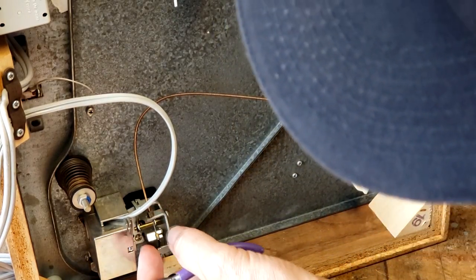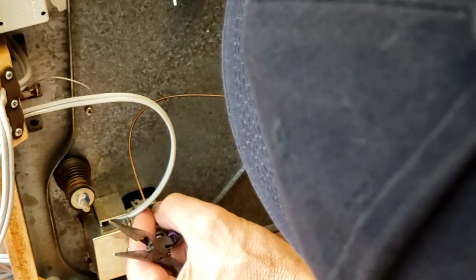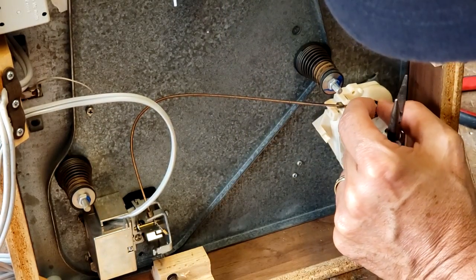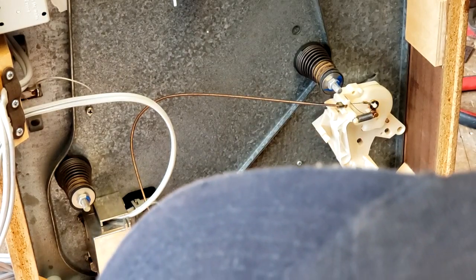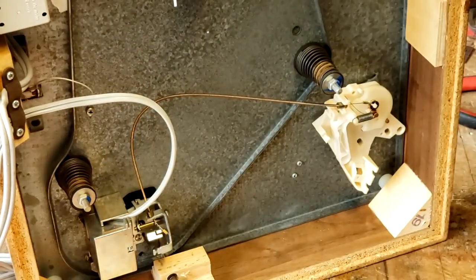we're going to remove, this is disconnecting the cable to the tone arm assembly. And actually we might have to do it from the other end because this thing is hard seated in here. And so I might have to pop this guy here, pop the whole cable off, pop it out of here, and then pull the whole assembly through. Or what I can do is actually unscrew those screws and pull this assembly off. I think that's what I may do. That way I don't have to touch any of this brittle nylon and plastic over here, which could break. I'm very familiar with taking these off on the TD-165 turntables. It's exactly the same arrangement.